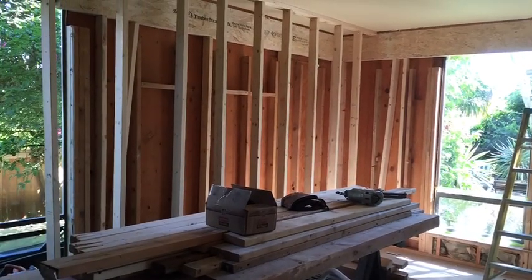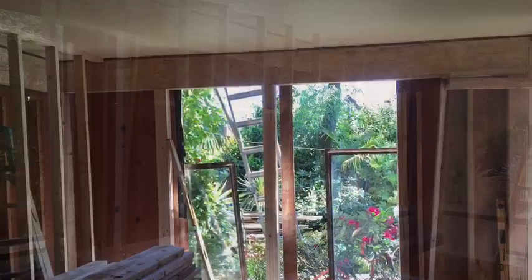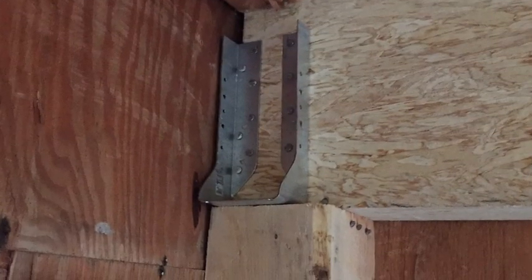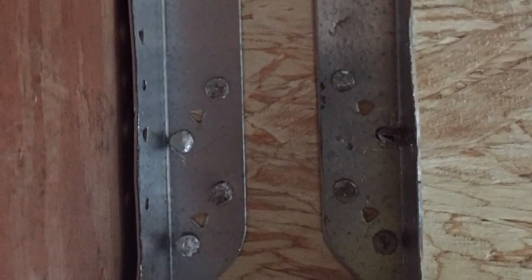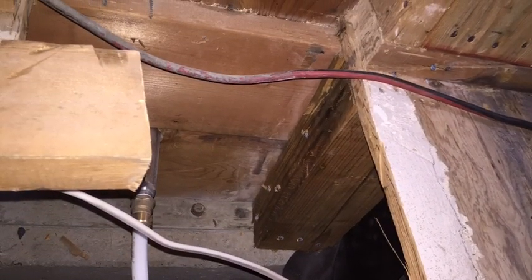Just put a lot of nails in — it's easier to take the nails out than to fix a collapsing house or a sagging upper level, because that takes a lot of different things. Another quick suggestion: if you've got a heavy corner project like this one holding an upper level, I also braced it in the crawl space. Make sure you have at least some kind of bracing in the crawl space or basement, just so the load transfers properly.